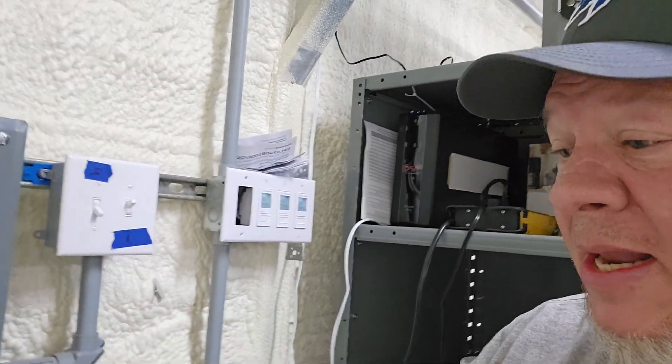This is a special relay that we have that goes outside — our very close friend Jim, an electrical genius, so to speak. We've got high-amperage relays on there, so you can't use a regular light switch. If you do, over time that switching is going to cause problems either with the motor or burn up the switch contacts. The switch contacts can't handle it.